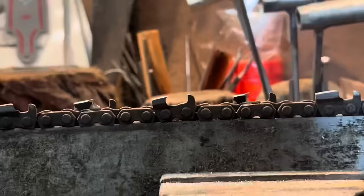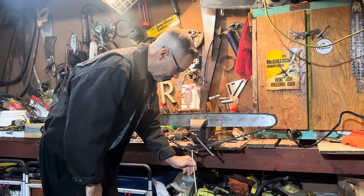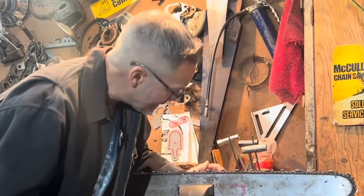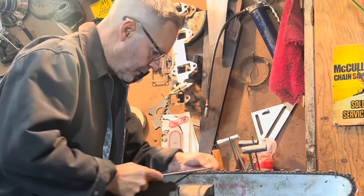Let's come back here. This is what's going on - I've got this little thing here on the bottom that pulls up the slack of the chain. See that? Because it's loose - and if you don't have it tight, so I pull down on it and it's super tight in there. Friends, this has to go. This gullet stuff has to go. I can see what this gentleman was doing - he was actually filing like this.